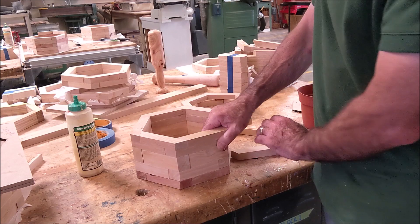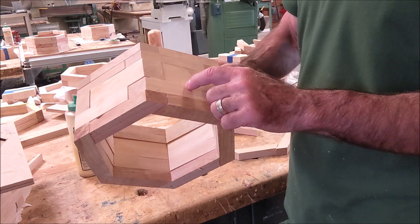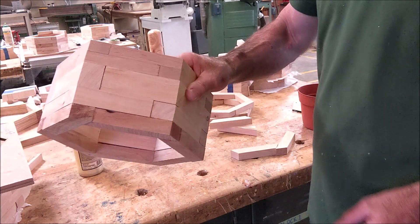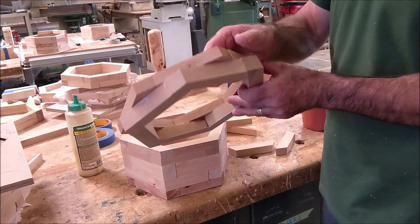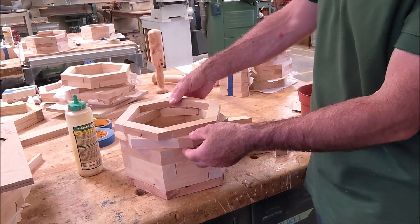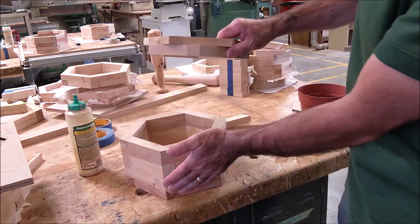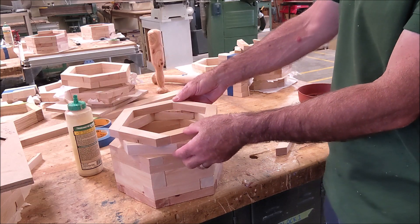You can see my bottom layer is actually rough cut — I never planed this board. This is cedar, this is alder. I think probably one, one and a half; that's three-quarters, three-quarters — so different heights of boards. I also have these two rings that I glued up separately, and I think I'm going to put the top on like that. Before I glue that top on, just to make it a little more irregular, I'm going to sand the outside first, and then glue that on there.